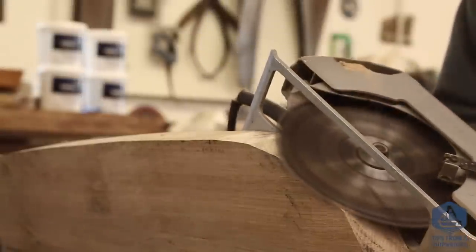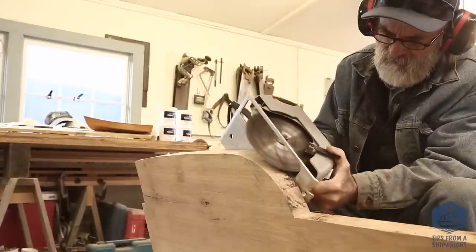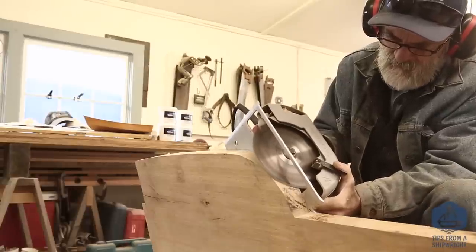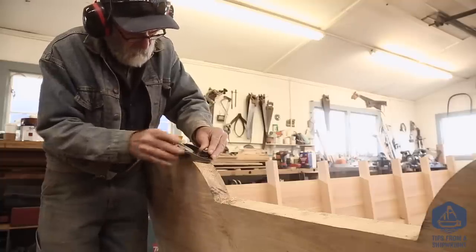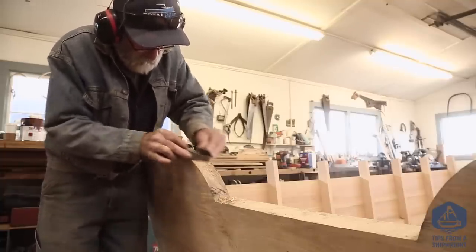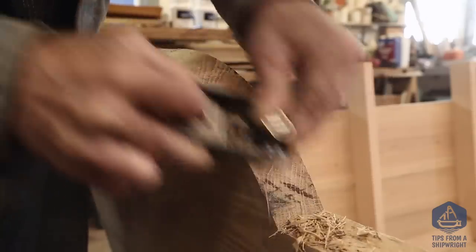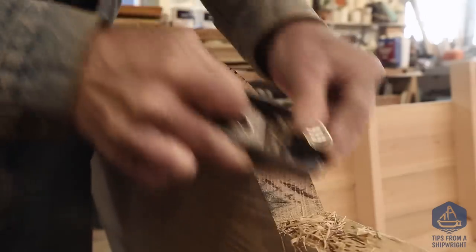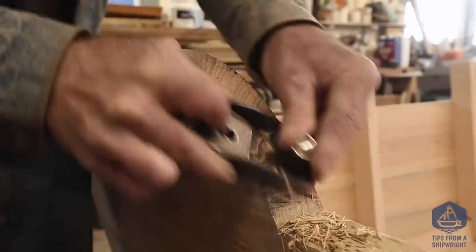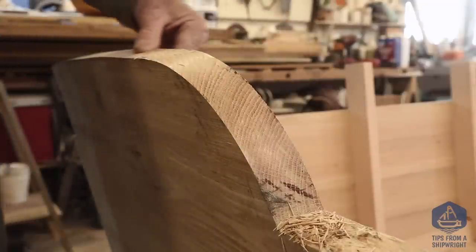I'm sitting on this little stool, I feel very comfortable. I also have to stop at the right spot here because if I carry too far with the skill saw I'm going to cut down into the transom where I don't want to, so you have to be pretty careful, but it's come out really nice. We're going to take a little block plane and smooth that curve up. The block plane's got to be really sharp for a cut like this - this particular wood right here is white oak and it's dense. I don't have the middle of the plane blade protruding down past the bottom of the plane. What I'm doing is planing with the corner of the plane blade, and it just makes it much much easier and takes a little bit of that vibration out. Now I'm just going to check and make sure that this side is the same shape as the other side. It's nice and smooth - looks great, I'm done.